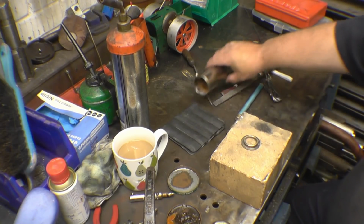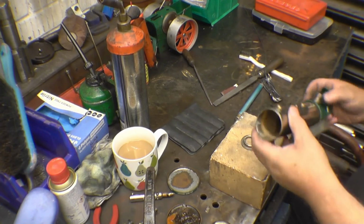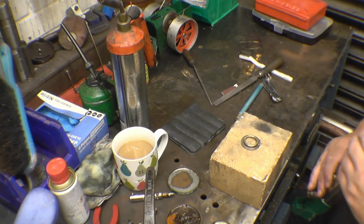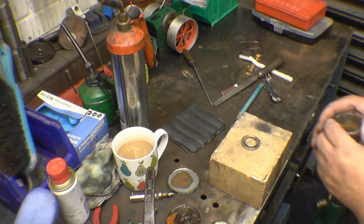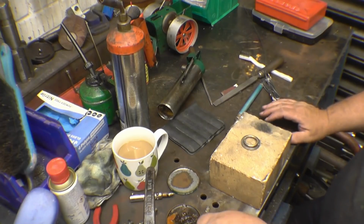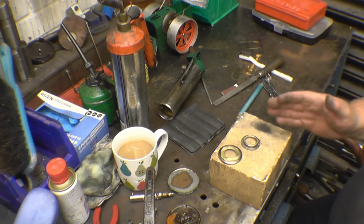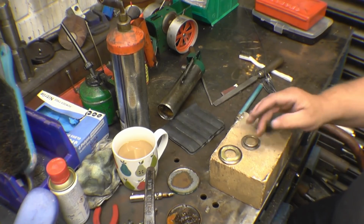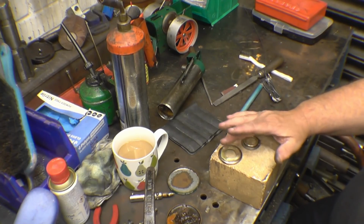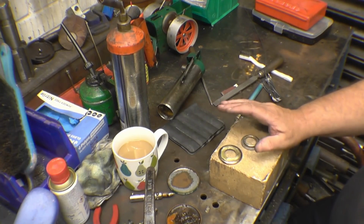Right, John had a problem with his boiler, tried to fire it up. And I suspect what's happened is somebody's let it run dry, and the solder's come undone. Now, John is used to working on big stuff, not little stuff. I'm the opposite way, I like working with little stuff. Now the thing with solder is cleanliness. Remove as much of the old solder as possible, because solder can oxidise, and you might think you've got it soldered but you haven't, you've just got it lying on the top. So cleanliness is always the main point.